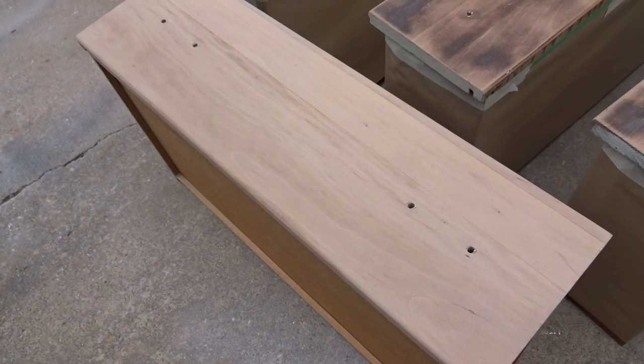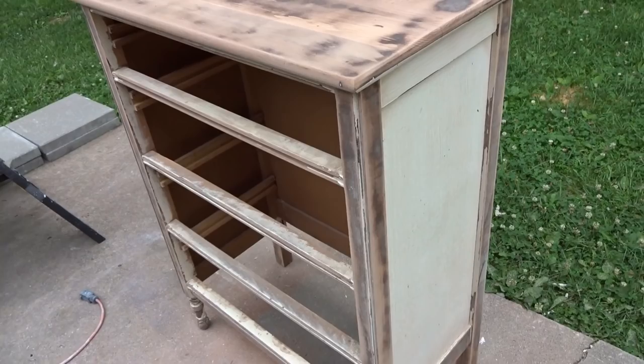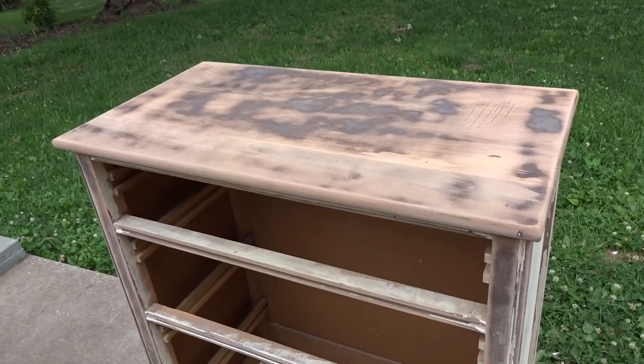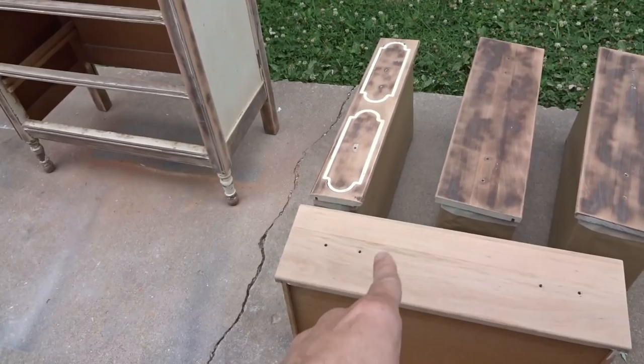For this piece — the one that's going to get the wood panel — I sanded it all the way down to clean, fresh wood, and I'm going to stain it a medium brown, then add my little trim pieces in a lighter colored wood. For the body, I'm going to spray prime it as well to hide all the spots where I sanded down to raw wood. But it needs a little work first — there are some deep scratches, a few gouges up front and in the middle. I'm going to take care of those with some Bondo, like you'd use on car fenders. It's a trick from a cabinet maker's website — it sands easier than wood filler. Once it's smooth, I'll prime it, then paint the body white, paint the drawers that green, and start on the stain and wood trim.